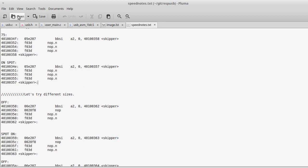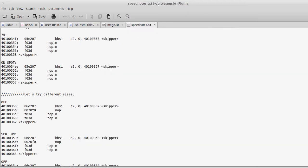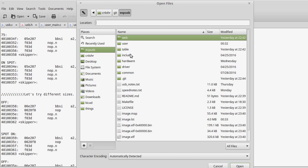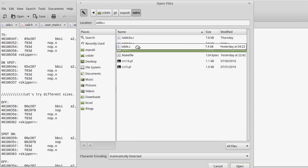So let's go back a few more steps here. In order to interpret USB, it's really complicated because there is the differential aspect. There's this bit stuffing thing where if you see they're the same for six cycles, the seventh cycle has to be flipped, and that doesn't actually mean a zero. And there's so many things going on. It's an incredibly complicated thing at the lowest level.